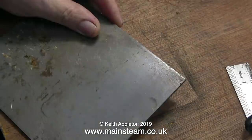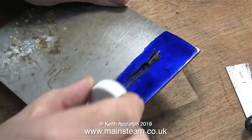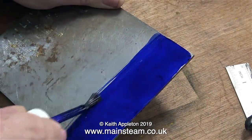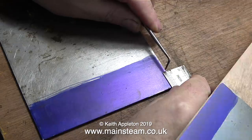I've found a suitable piece of steel plate. What I'm doing at the moment is applying some marking out blue, which was kindly sent to me by a man called Norman. This will allow me to see the scribed lines more clearly so I can keep the bandsaw blade on the line, or just off the line on the outside preferably.